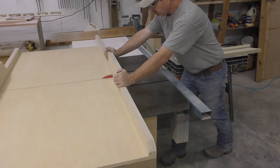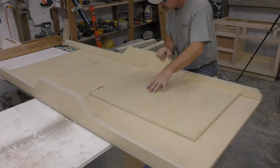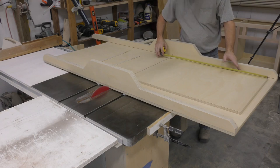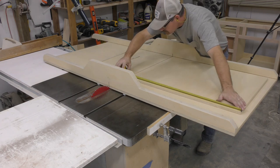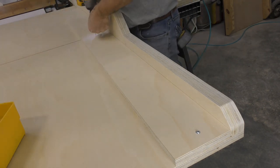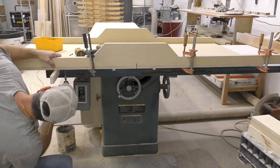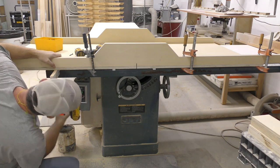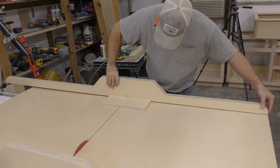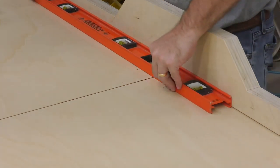Now we need to make our blade path before we can check for square. To check for square, I'll use a decent-size drop with a good edge against the fence and make a dust cut on one end, then flip the panel and use that same edge against the fence to make an additional dust cut. We'll check the dimension at the front and back of the panel — if the dimension is the same, your fence is square. I came up a sixteenth of an inch short, so I'll screw a straight-edge brace piece down to the deck, remove all but one pivot screw, adjust the fence clamp, and re-screw using new screw locations. We'll repeat the test, and once it's good, glue and screw the fence back into place using only new screw locations, then double-check with a straight edge.